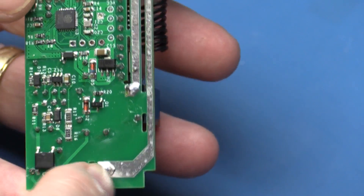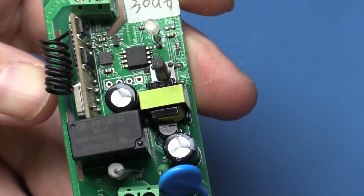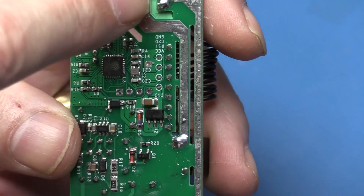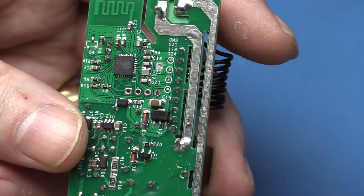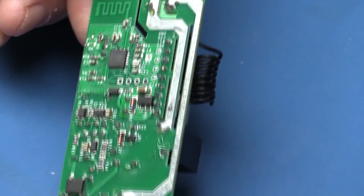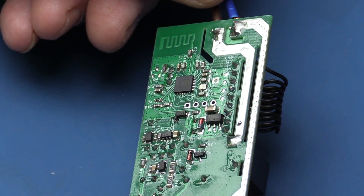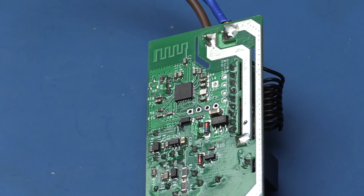The traces we saw on this side running down the outside - you might think that's not going to give enough power, but on this side there is also another trace running down the outside in parallel with it. So it's actually using the PCB circuits on both sides of the board. The bottom trace for the switch side is actually thicker than the neutral side, and it's very close to the edge of the board, but it's securely contained within the plastic box so that shouldn't be too much of an issue. I feel quite comfortable - if I had a few of these around the house I wouldn't be worried from a safety perspective. Of course they're not waterproof so you have to put them somewhere it's not going to get damp, but that's the same for most mains devices.